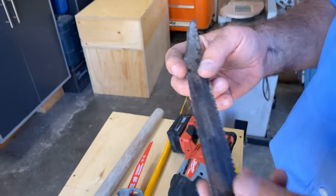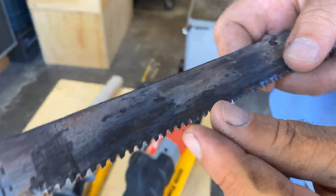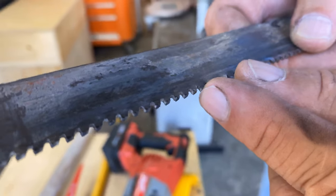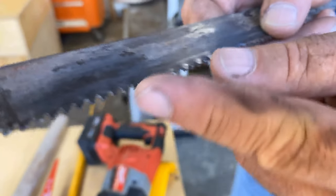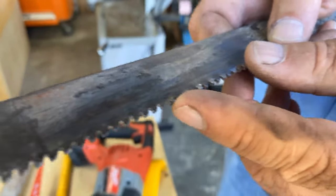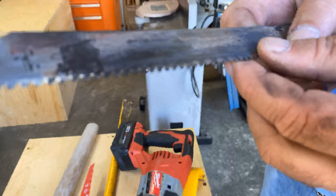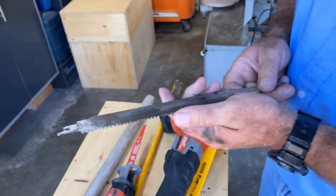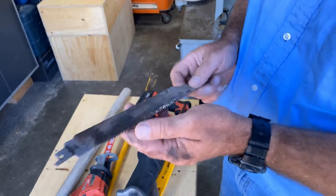This other kind of blade is interesting — I've used it quite a bit and it's still pretty much as sharp as when it was new. It actually has carbide teeth. You can cut metal all day long with this thing. As long as you don't go too fast and develop too much heat on the teeth, it will stay quite sharp. It will go through non-ferrous metal, copper, electrical conduit, steel pipe, all kinds of spikes and nails, and just keep going. I actually used this blade in a test and made hundreds of cuts through thick 12-inch spikes with it. It works really well.